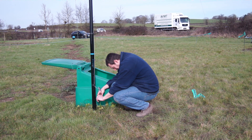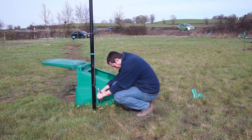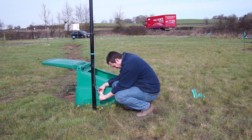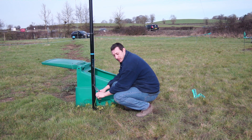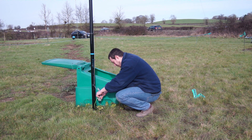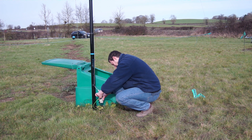That's the first test complete. I'm going to disconnect my little mini radial with the short ground rod, and put my big ground radial system on now — the one for the 80-metre quarter-wave. We're running this late afternoon — started the first test at quarter to three and it's now quarter past three, so it's had half an hour. Just nip that up nice and tight for a good connection.